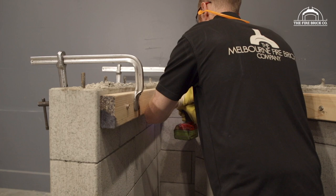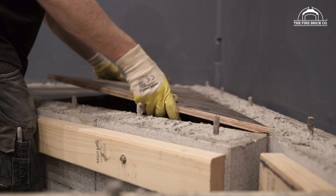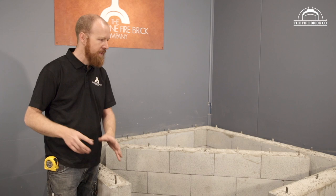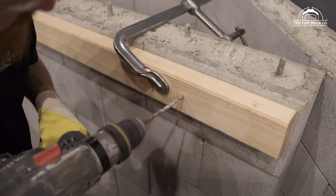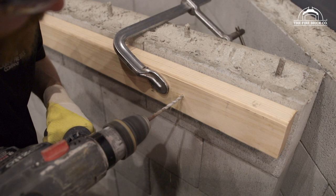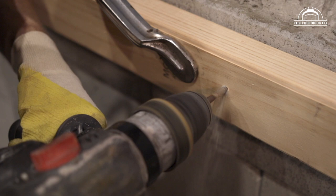The first step is to attach supports for our timber formwork to the blockwork. Once you pour the cores you need to leave them to set for at least 48 hours before setting up your formwork. The concrete in the cores sets rock hard and enables you to drill into the blocks so you can put in screws or other anchors to hold the formwork up to the block.